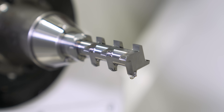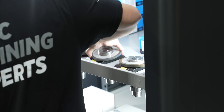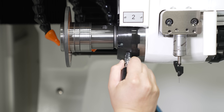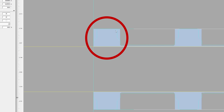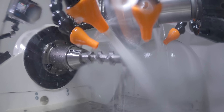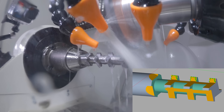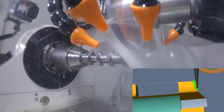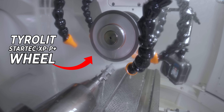With the completion of the third pass, the tool has made the shape I wanted. Now that we've roughed out our blank, the next thing is to create a clearance profile operation to establish our OD cutting clearances and 45 degree chamfer clearances. We're going to start at the front of the tool and work our way back, and we'll change wheels for this operation. For each clearance profile I'm going to follow the profile of what I want ground — the probe will touch all down the length of the flute to establish where the 45 degree is and where the outside diameter cutting edge is. Then I'm going to assign a wheel to follow that probe and follow the contour of my clearance angles.